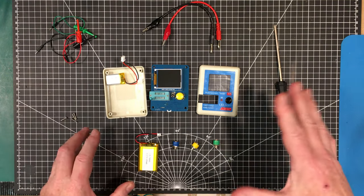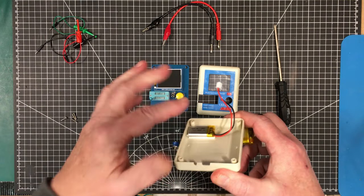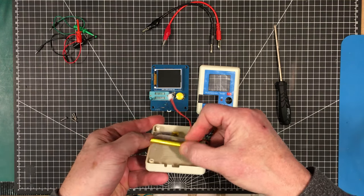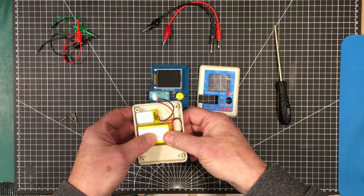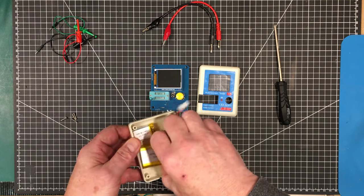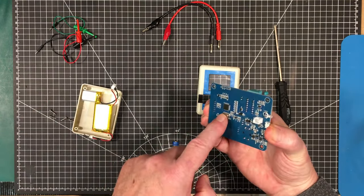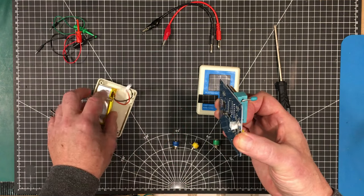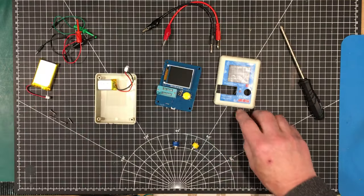Now there are some considerations. This battery is considerably thicker than this one. While the original one clears the other side of the board fairly well, if I just put the new one in with foam tape it would be considerably higher. So I'm going to put it in with carpet tape, and I'm going to orient it so it doesn't extend over any further, because there's a crystal that comes down and I think it might just contact the battery — though it just seems to clear it.